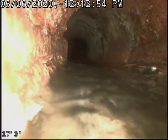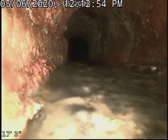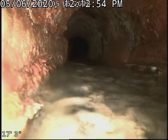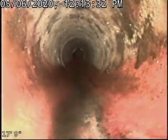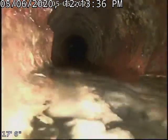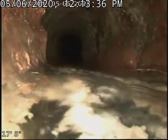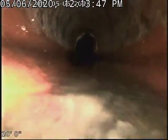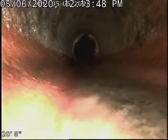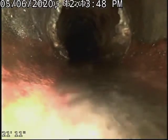Right now this here is 17 feet away. We're coming upon your 4-to-6, where it goes from the 4-inch cast iron to the 6-inch outside. This 4-to-6 looks shady. But let's check outside. This hub looks okay — we got some calcium buildup.